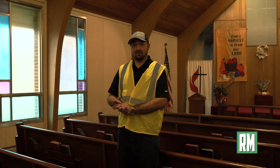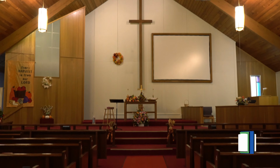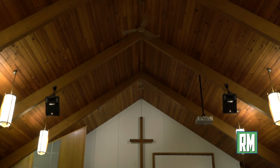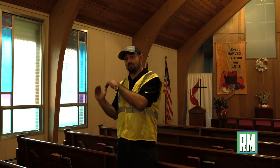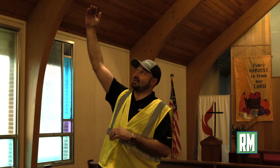We're here in the cathedral. I just wanted to point something out. Whenever you have tongue and groove ceilings that have a cathedral design like this, more often than not, there's going to be no ventilation for the shingles, which is why we had to add the furring strips and the vented T-drip, to get air coming above this decking and below the shingles.